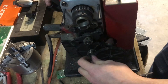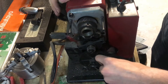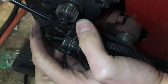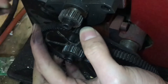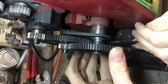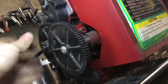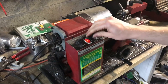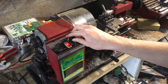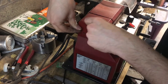Now I'm going to go ahead and screw these caps back on. Make sure the gears don't slide off, and also have to tighten the banjo down in both places. With all the gears meshing, go ahead and tighten up the banjo and make sure everything is nice and tight. Now the gears all feel pretty stable. When we turn on the spindle, you'll notice this is moving much slower. We want to make sure and cover it back up so things don't get caught in the gears, then we'll try to cut something.